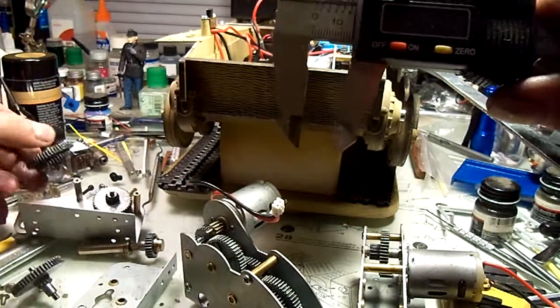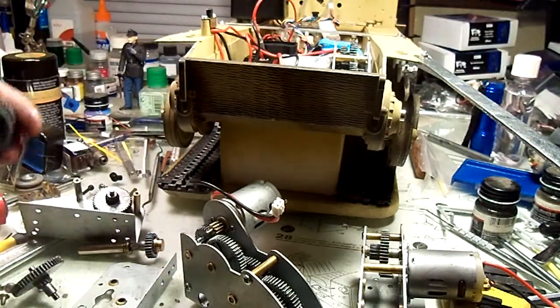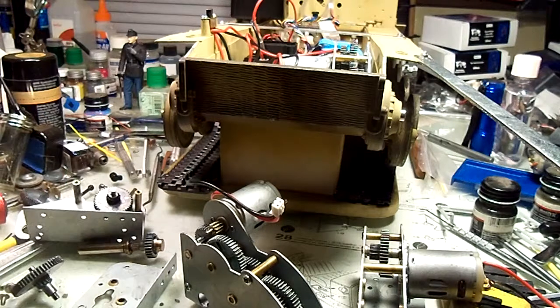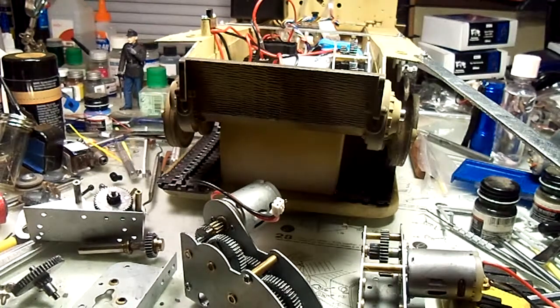So when you get a similar gear, if you want to know if it's the same kind of gear, you can see from comparing them whether they match or not. The point is: you do the span measurement — we got 4.745 over seven teeth. When you check the gear you're going to replace it with, as long as that span measurement and that outside diameter are the same on both gears, you're good to go. That's all you need — OD and span measurement. If they match, you can use it.